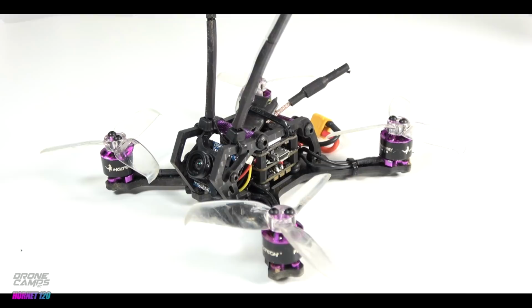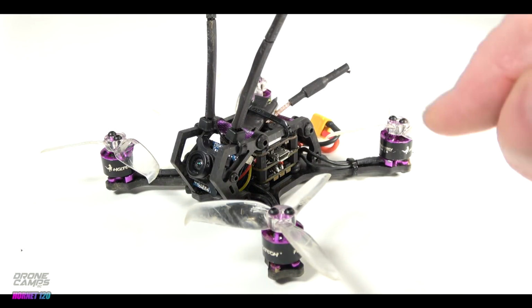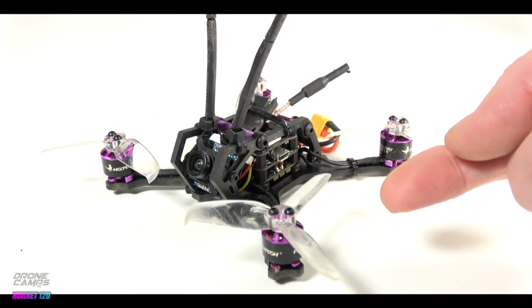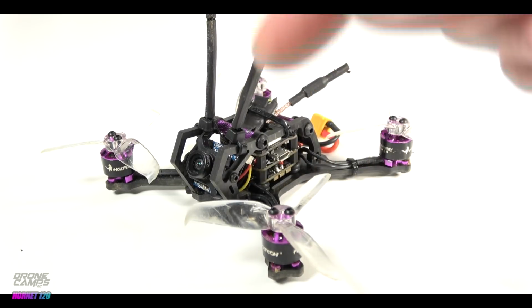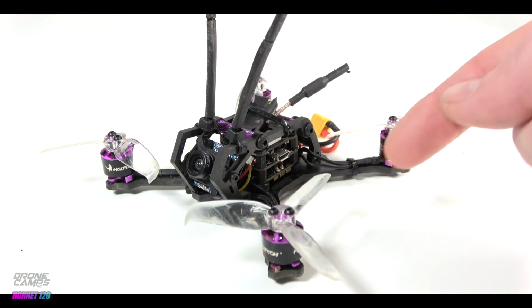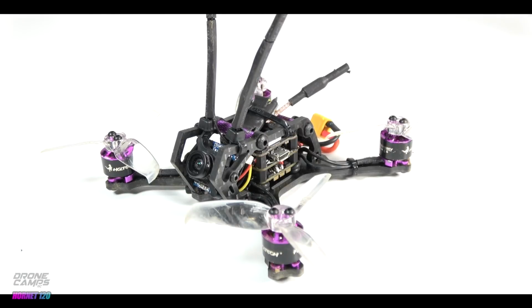brushless micro right now. And what I mean by sweet spot is when I'm flying a 2-inch quad, I feel like I have to full throttle a lot when I'm coming back around in those big maneuvers close to the ground. I need full throttle not to fly into the grass. So with 2.5-inch 1106s on 3S, when I come back around from that really big maneuver, that big beastie maneuver, and I want to just come in fast and low, I have enough throttle here that I don't have to be full throttling the whole time, which is really cool.